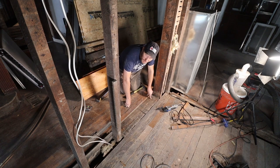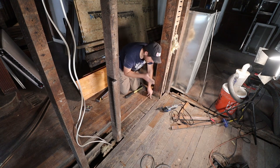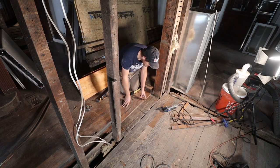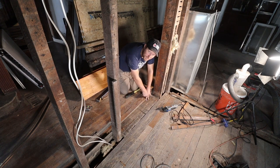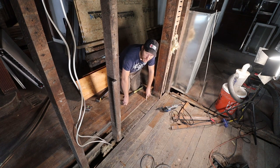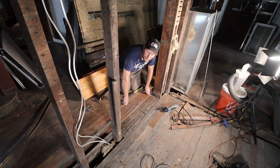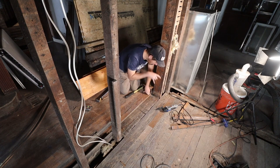I have a pillar right underneath here. That's also why I'll be choosing this spot, because we have a pillar in the basement that sits right underneath here, starts at 87 inches, which is right here at this joint. I'm actually going to go a little over, but then I basically need to take this 6 inches of the floor out, because the floor doesn't have any support right underneath here, so I wouldn't pass inspection. There's a big wood beam underneath there, an 8x8 beam in the basement that sits on top of the pillars. So I'm going to take this floor out and then support my wall on this beam.